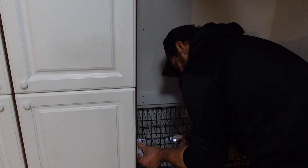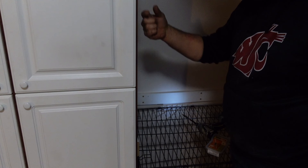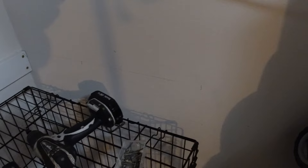I didn't realize there's about an eighth or quarter inch skin on the outside of this cabinet, so it's actually an inch thick and the screws were only going into the skin. I went and grabbed some inch-and-quarter screws with a square drive — just using what I've got to reduce cost. Ideally you'd want something recessed, but it's all good. On this side I'm going to mark out where the stud is, and since I don't want the ledger board to run past the shelf, I'm going to use these metal drywall anchors that screw in — they grab really well and hold a lot of weight.